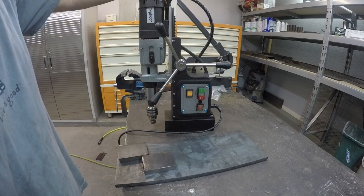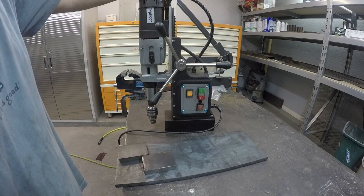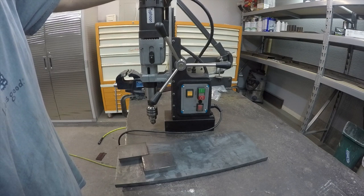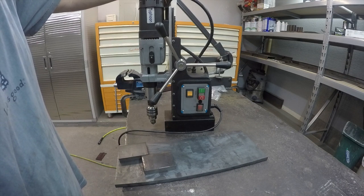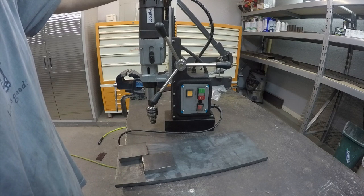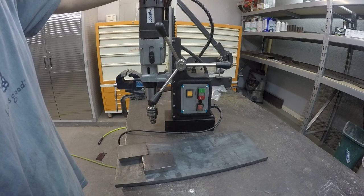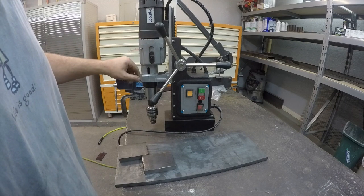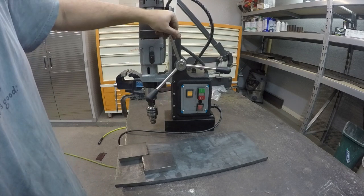But also the milling machine, if you're drilling holes up to maybe 3/8 inch, man, it'll plunge through those very, very quickly. But once you get above that, the milling machine doesn't have the torque required to drill a large hole. It's got torque and power, but way up in the RPM range. And obviously, when you get bigger drill bits, you need to turn those a lot slower. So this guy's just a two-speed. It's 260 RPMs on low, 480 RPMs on high. Serious torque in this machine.